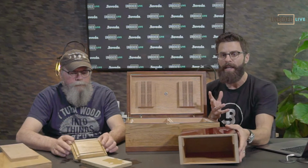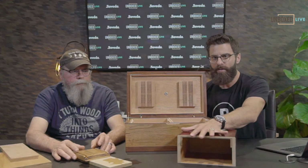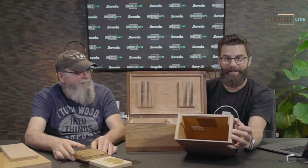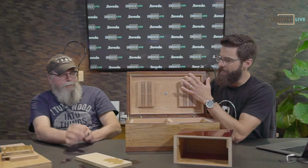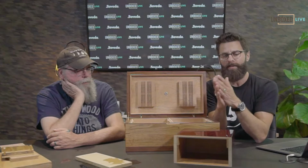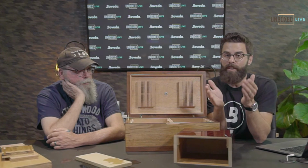It doesn't matter what's going on in the hygrometer, because a hygrometer can only understand the amount of moisture that's in the air, and there's the cell structure of wood. And to be honest, this has no cell structure. Well, it has cell structure, it's chopped up pieces of wood. So really, you're not even dealing, and because it's so paper thin, that veneer, you're not even really dealing with a good base to absorb the moisture. There's bound water and free water. You can look it up. There's tons of different articles, but you're really only using free water. Bound water is already done.